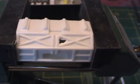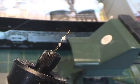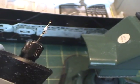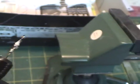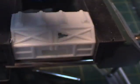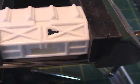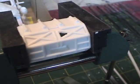Okay, and you can see the cut there. However, before I go on, I wanted to show you the drill bit here, and you can see when you run it at a higher speed, the plastic has a tendency to melt on it. This can be cut away with an X-Acto knife, so I'm going to peel that away and work on this hole a little bit further. Alright, so here we have the hole that's been cut out, and now I'm going to take an X-Acto knife and trim this away, and then I'll start using the files.